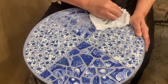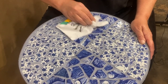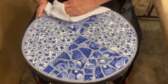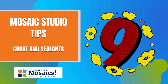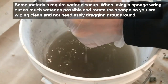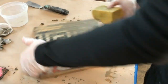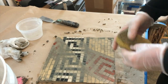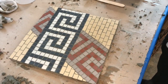You can see that just with the t-shirt, this haze is coming off, and that's because this is a glazed tile. If this was unglazed or something a little rougher, you might need to put a little more effort into cleaning it up. Too much water makes your grout weak — really wring as much water out of your sponge as possible, because we don't want to add more water to our project. We're really just wiping it, getting the excess off, and then we'll let it set up a little bit and buff it off.